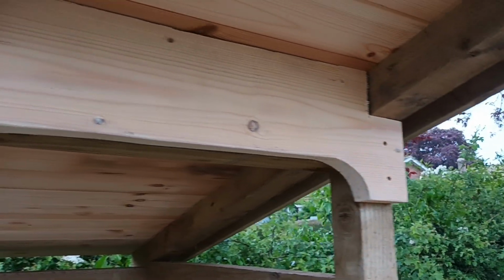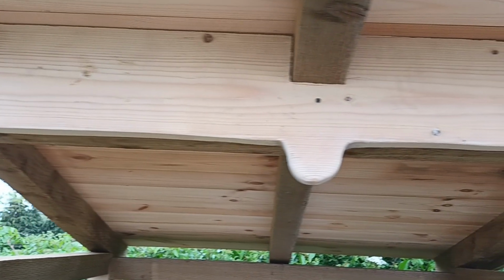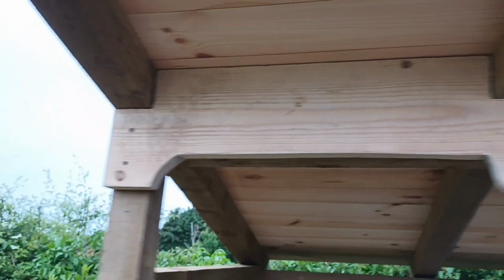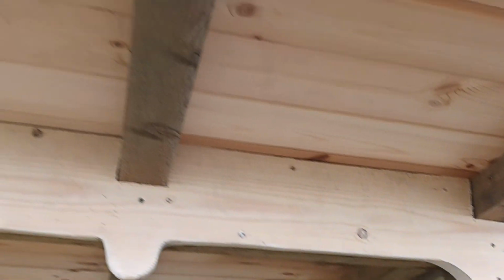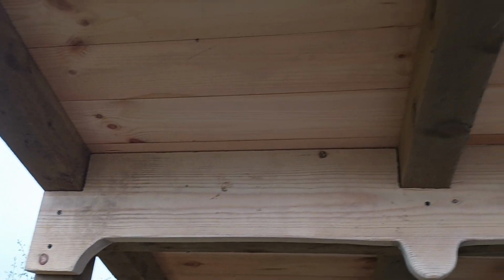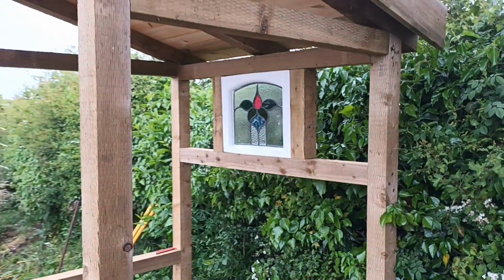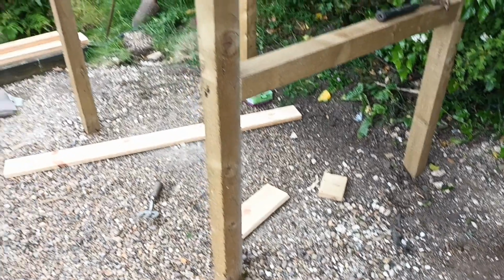Now I ended up putting 3 of these fins on here on the roof, because we have to pin that woodwork to something, and it would be way better to have it like that, because if you have that too wide, if I'd left just that section there and that section there, that wood would likely have bent and warped. So I've put that, they're probably 2 foot apart, which is about ideal. So I can't do any more now until we get the weatherboard, and it's not that expensive.